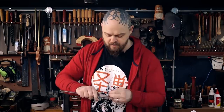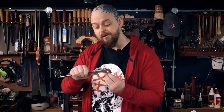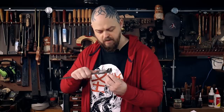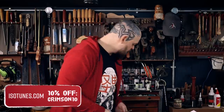Now, this is the fun bit. We have a 10.2 millimeter threaded insert. And I think it's probably an M5 thread, but 10.2 millimeters. So really what I want to do is drill out 9.5 initially, and then open it up a little bit. But I'm going to find my 9.5 mil bit. I do have the aluminium to deal with as well.